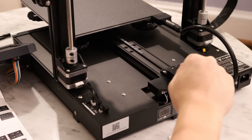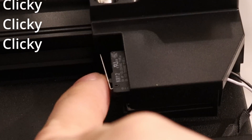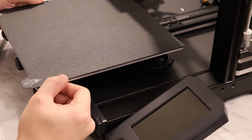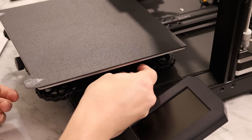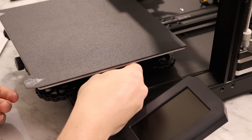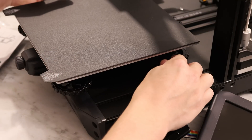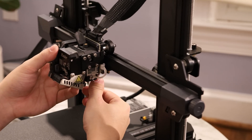Mechanically, this thing's put together pretty well. It looks like they're using higher quality switches — beefier than the normal switches you'll find on a 3D printer. The bed is a little loose, so I need to go in and tighten up the V-groove wheels. There's a little bit less clearance here than on the other Ender 3s. It might help to take off the screen to give yourself more space. The wheels on the X-axis are a little bit tight, so I need to loosen those up too.